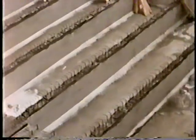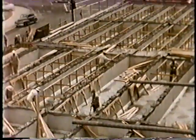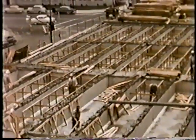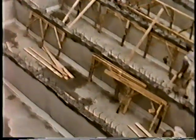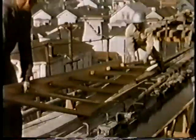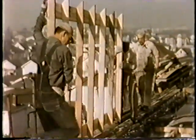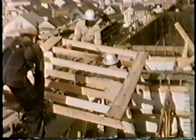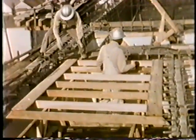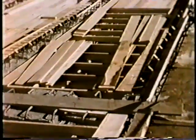It was a fast-moving job. While the stripping, cleaning, and curing operations were still underway in the third span, the carpenters set prefabricated supports for the top deck forms in the first span and were well started in the second. Pre-assembled joist units were set close behind.